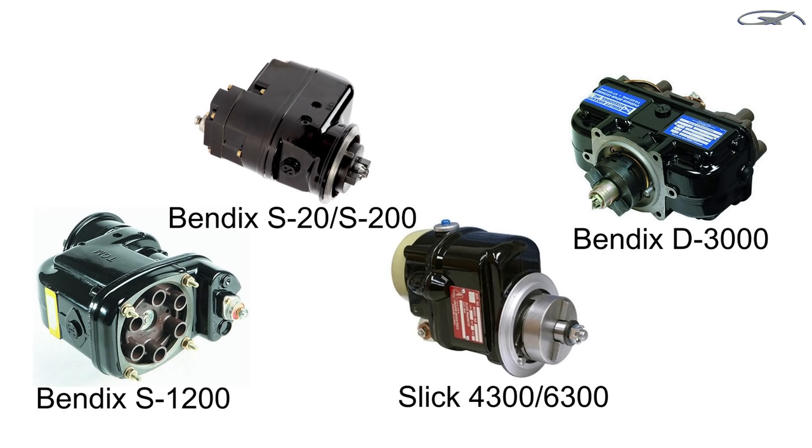Finally there is a mag that was made by Bendix, which is now owned by Continental and is used only on certain light Lycoming engines — it's called the D-3000. It's a dual mag: basically two magnetos in a single case with a single drive. There are a lot of us who think this dual mag is bad news and probably shouldn't have been certified, because it doesn't really give you all the redundancy the regulations intended when requiring dual ignition systems. There are some single-point failures of the D-3000 that will take out both sides of the mag — not a good thing.